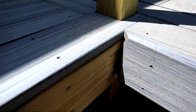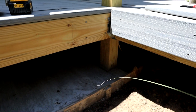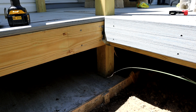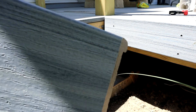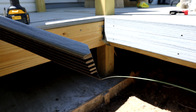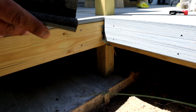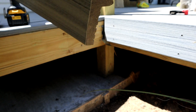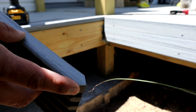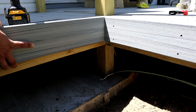Nice, a little tip here guys — you can see down in the back of this miter we have that corner bracket that's kind of getting in our way, and if we were just to do a straight 45 miter on the end of our deck board, that's not going to allow us to close it up too well. So a little trick: get your board, put your 45 on it, and then on the back side you basically cope the back of it out. Now just reverse the board around on your saw and bring the blade down and cut the back off. Just make sure when you're doing that, you don't cut all the way through — you got to maintain this top piece here because you're going to see that on the top part of the deck. No one's ever going to crawl into your deck and look at the bottom and see that this thing isn't flush. You just got to keep the top. When you do that, you butt this in here — see it closes that thing off real nice.